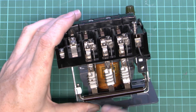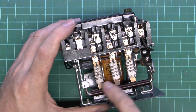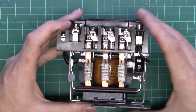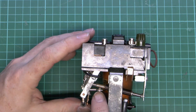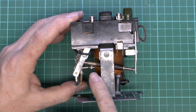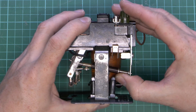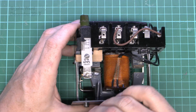And as I say, though it's a three-phase device you can just use it for single phase as well if you wanted to. And unlike the other device, these are all in decent condition, and the insulation underneath is all intact, so clearly in a much better state. So just as with the other one, when these heat up, these strips underneath will bend, as they're bimetallic, and then when they bend enough it will basically push this bar upwards, and then we can see on the side here there's a little pin there which is an electrical contact. So in the normal position it's like that, but as this moves outwards and these bend, it will actually just move this and basically break the connection. The actual position of when this breaks is determined by this piece on this end, which you can see can be adjusted to various positions. We can see here the actual amp rating, which is 0 to 4 in this case, and that's fine for the motor we've got which is about 2.5 amps.